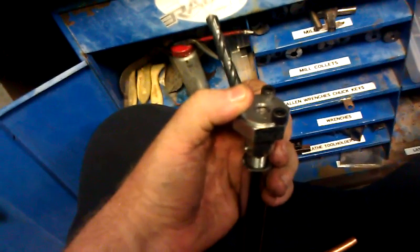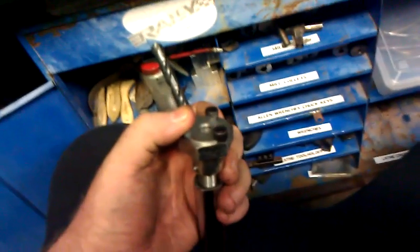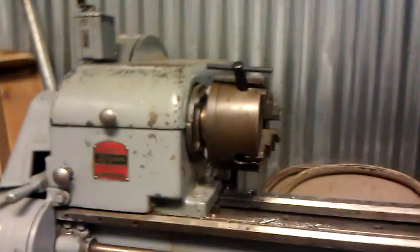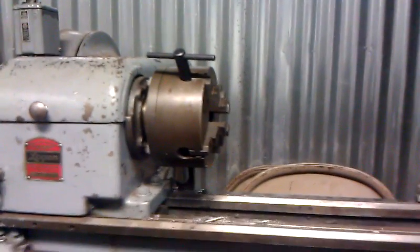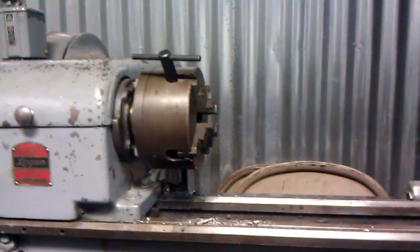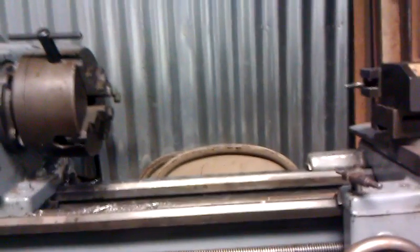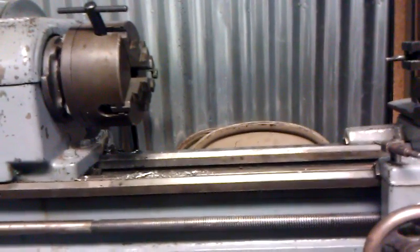So this thing is going to be short and relatively brutal for a 9mm by the time I'm done. I had this lathe — dated 1951 — learning how to use it properly: how to center things up on a four-jaw chuck with four independent jaws, how to test centering at two different axes, two different points on a shaft instead of just one, so you get the entire shaft running full length concentric. Relearning all those things has taken me some time, plus I had to take a little bit of time out for a particular political action.